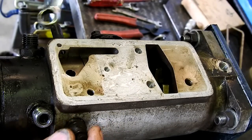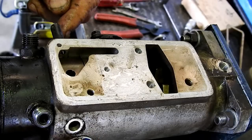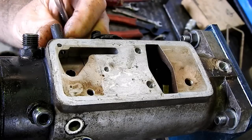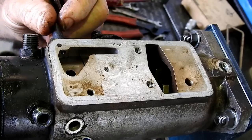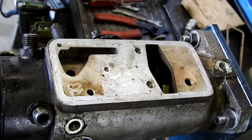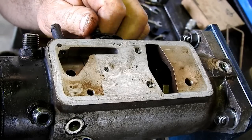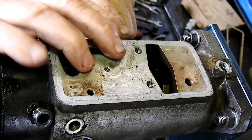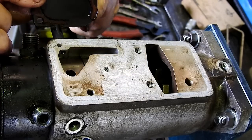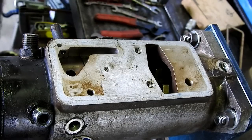This normally isn't a bleeder. They often had a bleeder on this other side down the body and a plain bolt over the back. You just wire it like that, I'm not sure. And this little screw's going to hit on that fella. The side plate. You may have pulled the side plate off when you were taking the pump off, this little fella. It's only two screws. And you probably lined it up with the letter G or W or something like that.